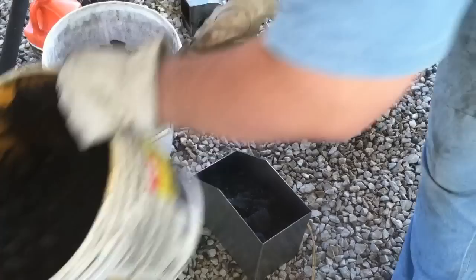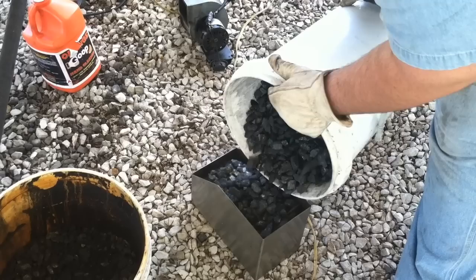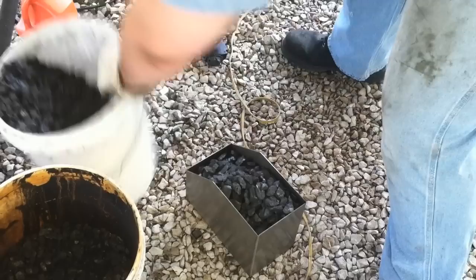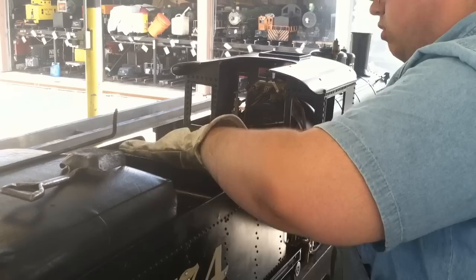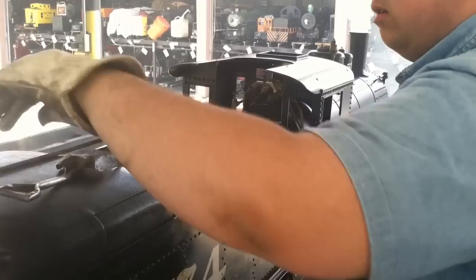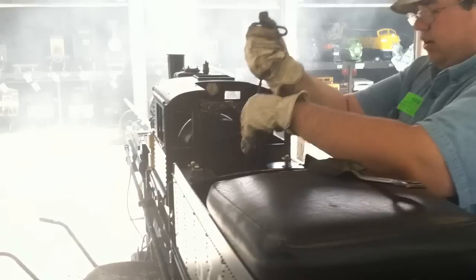Before we go out and run, we need to fill up the bunkers. I use a mixture of anthracite and bituminous coal — the reason being that both get out good heat, but anthracite burns a little cleaner with much less smoke. However, you can't burn anthracite by itself because it has been known to melt the grates on some locomotives. It's about a 50-50 mix. I do recommend making one of these little bunker holders — it makes life a lot easier. Just go in with your poker or shovel and swirl it around to get everything evenly mixed.